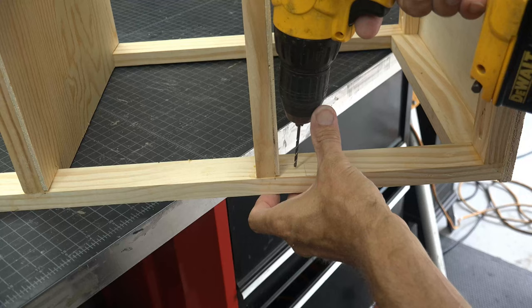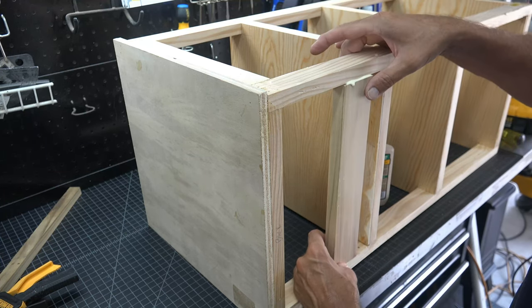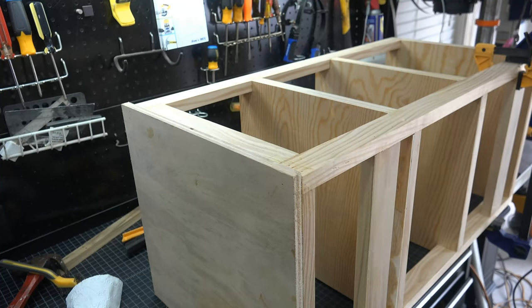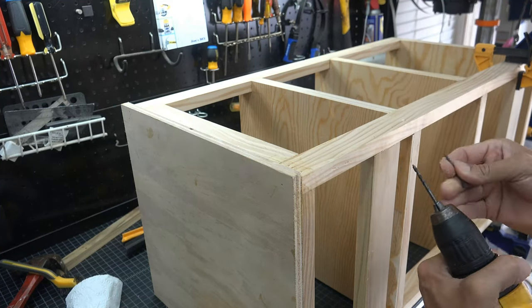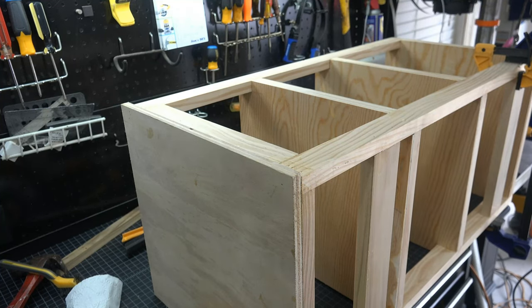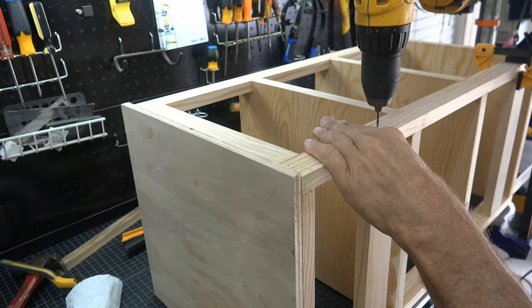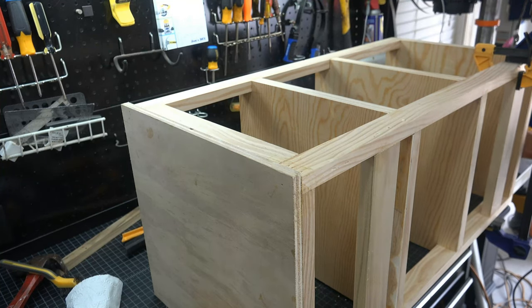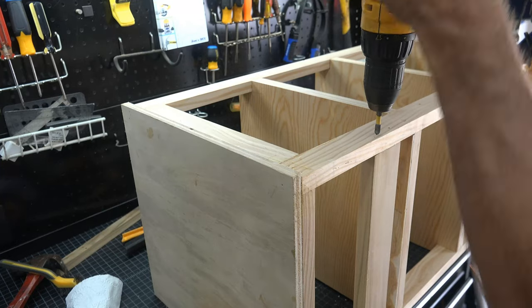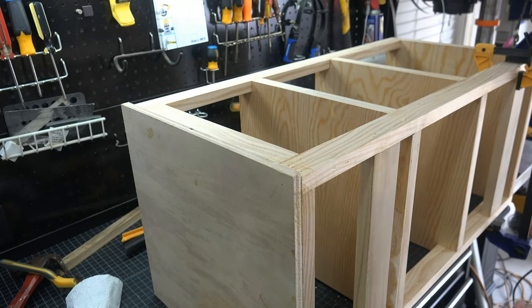The better way I came up with was using dowels. Start by placing two boards flush across the back of the box, drill pilot holes, and secure them with both wood glue and screws. This will make them stronger and able to take on extra wear and tear when taking apart and putting the box back together. Very important: don't skip the pilot holes. Check the length of your drill bit to make sure it is the same length as the screw, then drill your pilot holes — we don't want to split any of the soft pine. Here is a quick trick for pine: because the wood is so soft, when you change out your drill bit you can actually use the screw tip itself instead of a countersink bit — it gives you the perfect shape for a screw head.